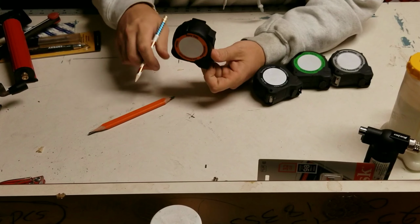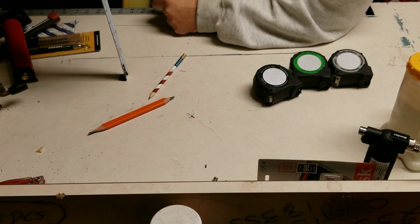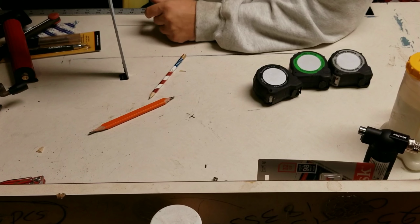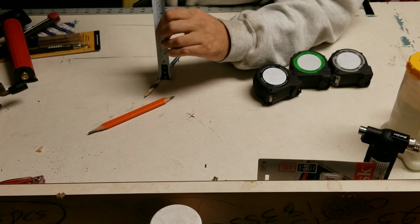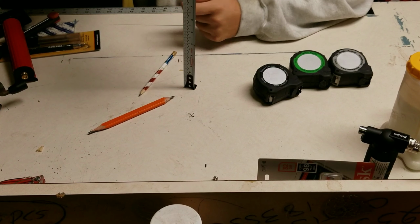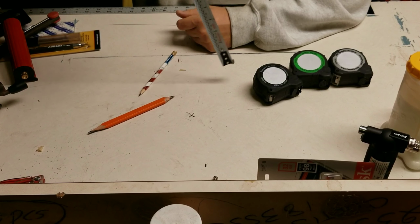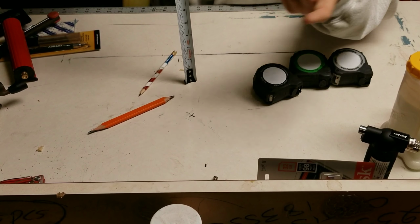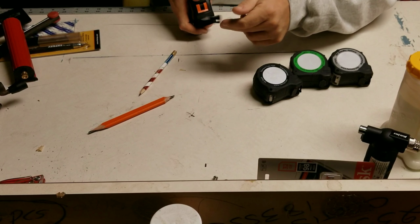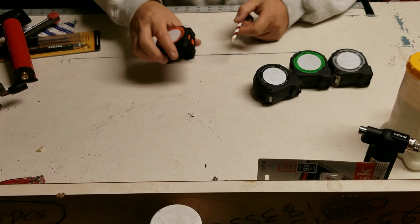And it's also good for measuring heights, like when we do bar tops and we want to make sure, you know, we use a level, but you can make your mark wherever you need to and walk this tape down, make sure you're still at whatever height you're at, 42 inches, 39 inches, whatever you make your height to. There are some standard measurements, but I've also done different things for different clients.